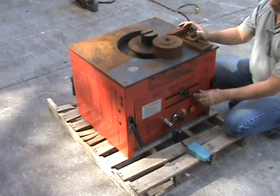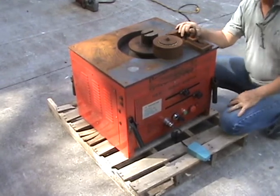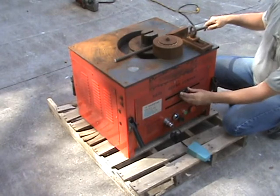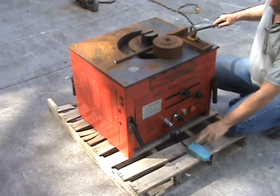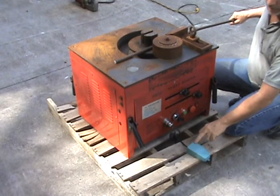To give you a demonstration, I'm going to do a quick one here, taking a piece of 5/8 grade 60 rebar and we're going to bend a Z. We're going to set the first slide at 90, laying the bar in against the shoe, and hit the foot pedal right here — and you'll see a 90, which is part of our Z.